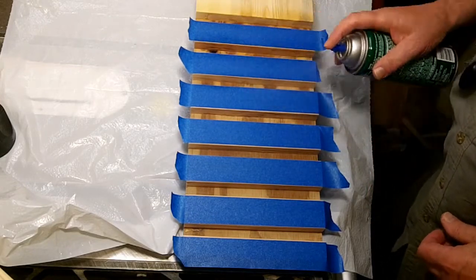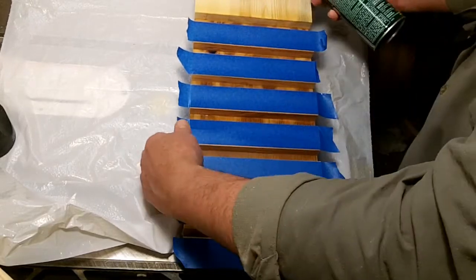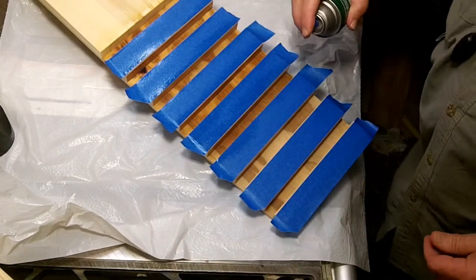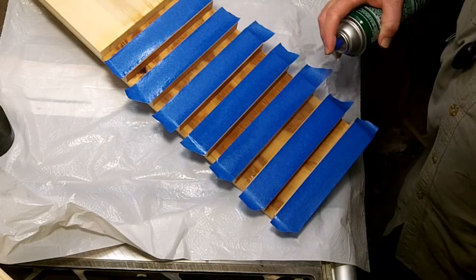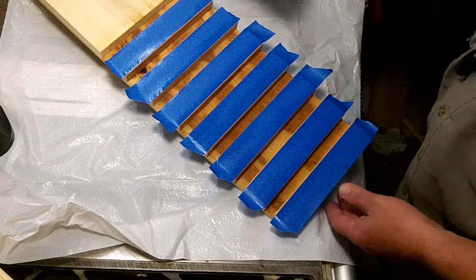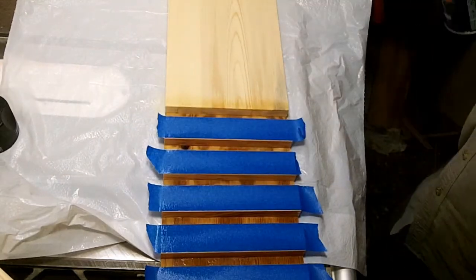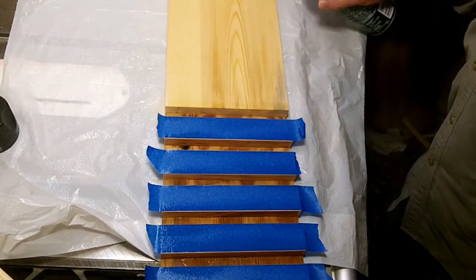Another thing is, if you use these quite a bit during the summer, you might want to periodically give them another good coat of spray or two during the summer. And give the slick plate especially, because the sand moving down in it will tend to wear this spar varnish off.